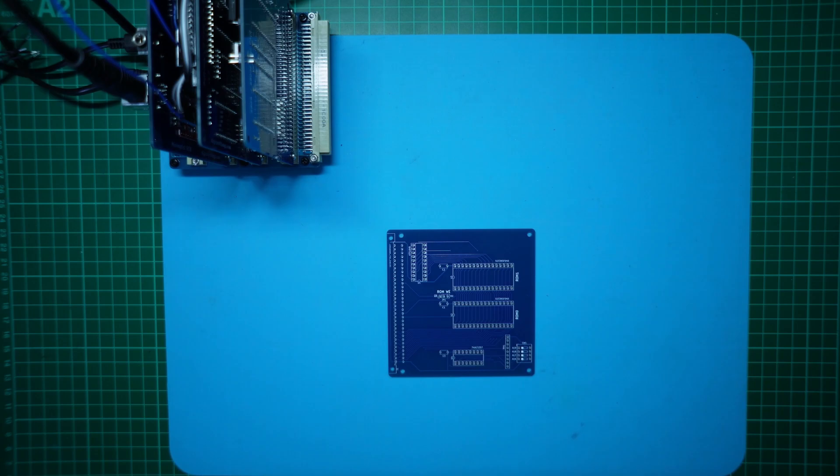Some form of game controller or keyboard will also need to be devised. Originally I was thinking of just using a backplane card slot as a custom cartridge slot for installing pre-programmed ROM game cartridges, similar to the original game console cartridge experience. But after expanding on this idea and after checking what appropriate DIP ROM chips were available at a reasonable price, I arrived at the thought of instead making a bank-selectable 1MB ROM expansion card.